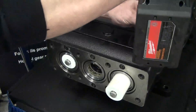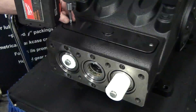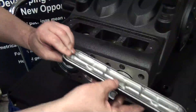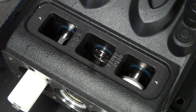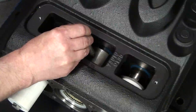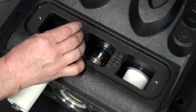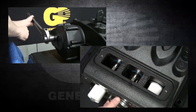On top, remove the two 5mm bolts from the crankcase access cover. Rotate the crankshaft to position the piston guide to its rear-most position of the crankcase. Be sure to allow room for the packing pusher tool. Insert the packing pusher tool and rest it on the shoulder of the piston guide. Install the packing pusher tool, then remove the handle.